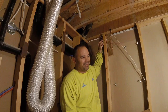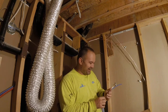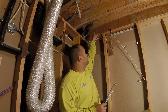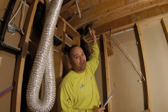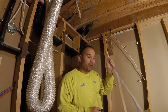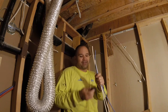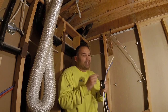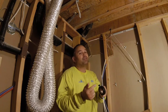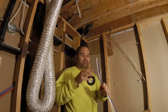We got it! With the hardest part of the installation done, it's time to run the wires from here to the bedroom above and then from the bedroom up into the attic. The speaker cables are going to go over to the volume control that will control the outdoor speakers. On this run I'm going to run a Cat 6 cable, a speaker cable, and an RG6. When you take these together, getting the strings in was pretty hard - it's really important that you do a good job taping this head. If the head comes apart and you lose a wire, you have to redo everything - so just do a good job taping the head.